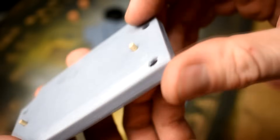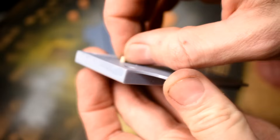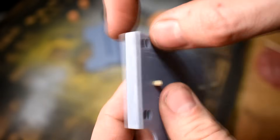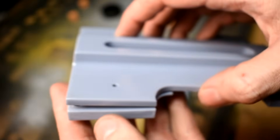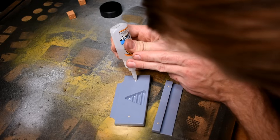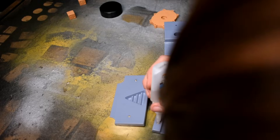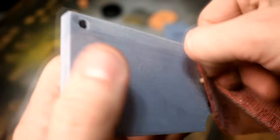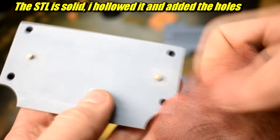We're flush up top, poking through on the bottom. We're going to have to sand this one down because we want this one to be tight. We're going to glue it in here — put a drop of super glue there — and sand this one a little smaller. We want it to be tight in this side and just locating in this one, but the pattern needs to be able to come apart really easily without pulling on it. It just needs to fall apart. These little dowels are always soft as wood. It doesn't take a whole lot. There's a fair amount of pattern prep no matter what you do — whether you're using wood, FDM, or resin printing.